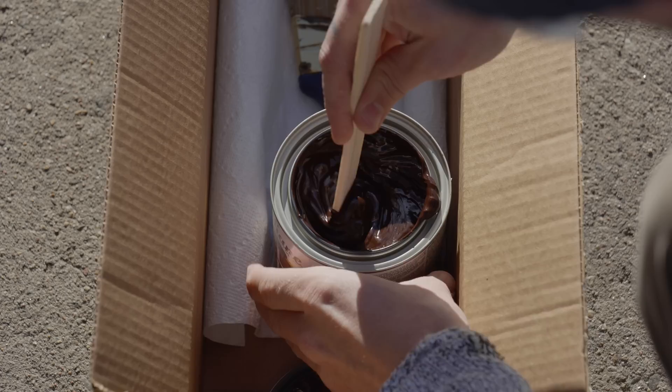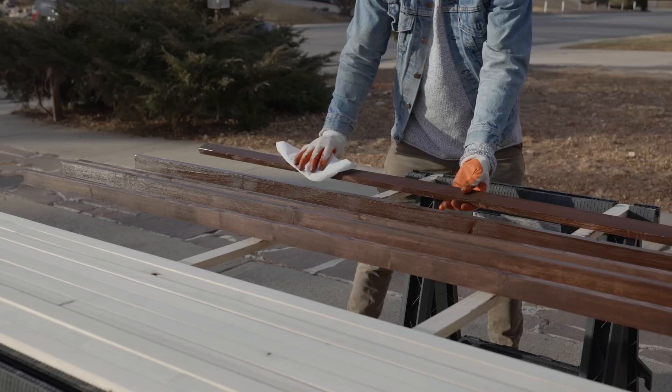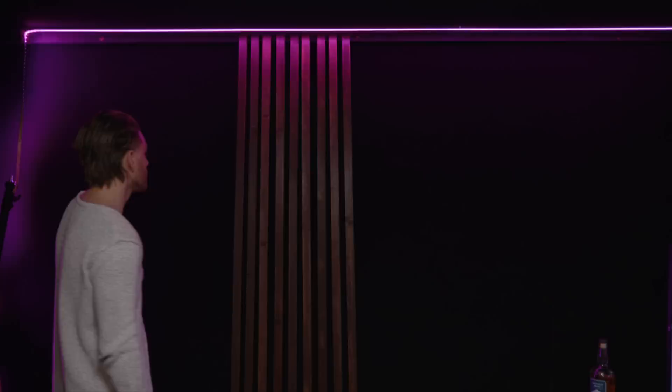After sanding, I needed to decide on a stain. I chose a walnut stain that looked great outside, but since I planned to have lighting shine on the slats, I needed to first test the color in the room where it would actually be. The stain color did not work and became more distracting with everything else going on in the room. I tried a lighter color — not any better. After staining about 10 pieces, I realized I just needed to paint it black. Tip: make sure you test the paint color or stain in the room before finishing the rest of the slats.